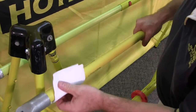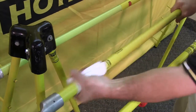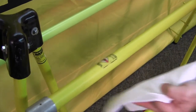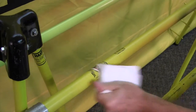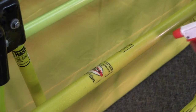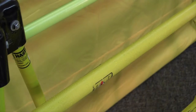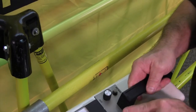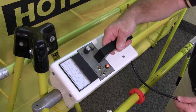I'm going to apply a liberal coating of the boom wax and hot stick wax in this area that I've cleaned. You can probably see the difference — it turns it a richer color of yellow. Then wipe it right off with a good clean cloth. That's one coat. I'll spray it with clean water again, and I can immediately tell it's beading up — that's what I want to see. Now we'll put the wet tester on here again — turn it on, make sure it's on wet test, zero it out. We've got a good stick.